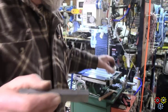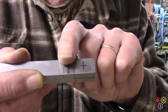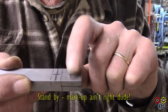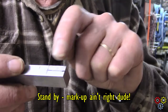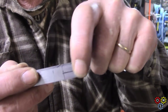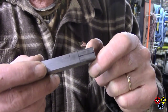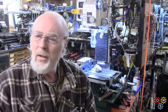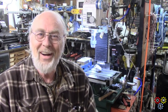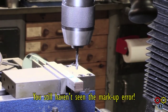Dead simple. We've just got to put a 3/8 through there, something through there — 10-24 or something — and then a slitting saw to get a pinch bolt. That's all there is to it. So I'll just get on with that and cover really what three operations it is — not a lot. Here we go, just putting a tapping drill down through both of these; it'll act as a pilot for this one.